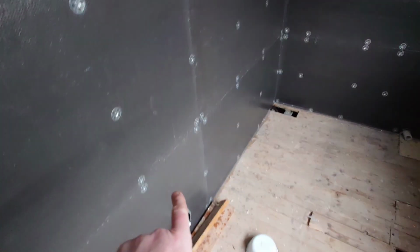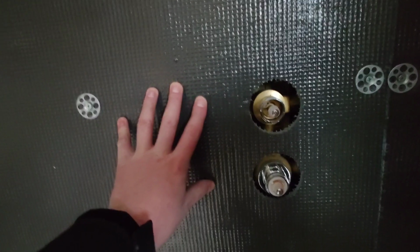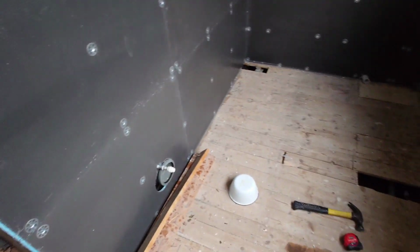So we've built this stud out, hid the pipe in the back there for the soil. Got a built-in shower valve. We're using the Larson thermal construction board. It's going to get tanked and tiled. Super waterproof, will never leak. And that's it, yeah. Another little job we got ticking over while the big ones are churning.